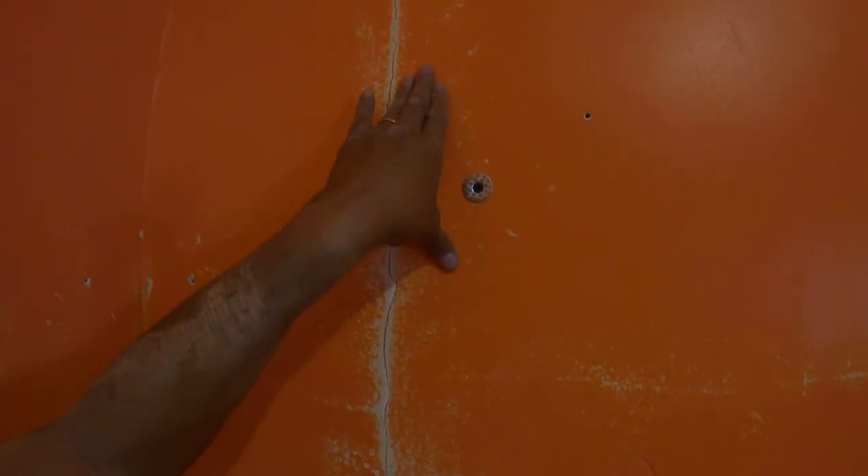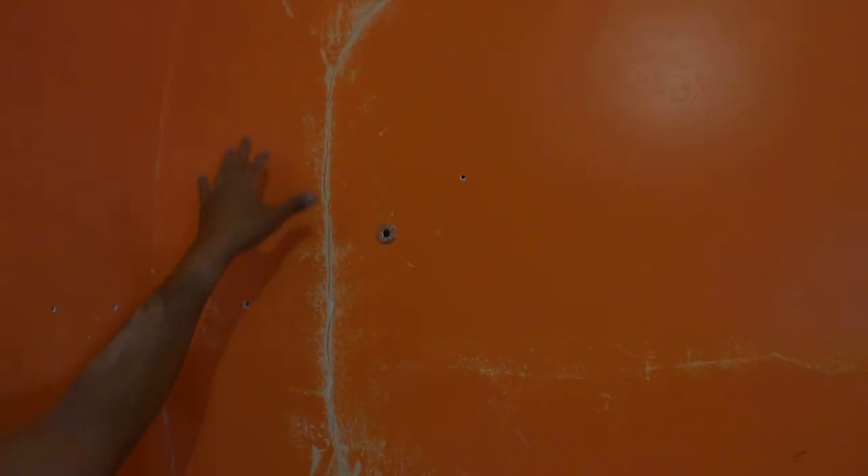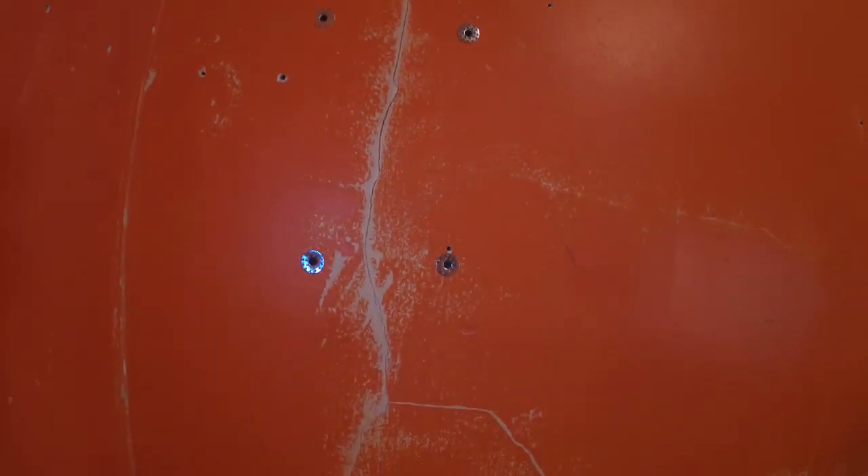Now it's flat — completely flat. This doesn't move at all. I'll probably need to put another one up here, but that whole side is down. When I put one on this side and tape right here, you're not even going to see it. That's repairing plaster with broken keys. You can't even see the washers up close — there are four to six of them on that wall right there.